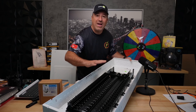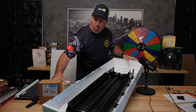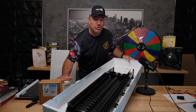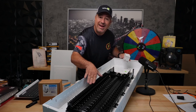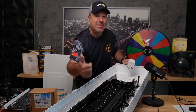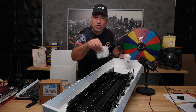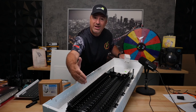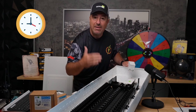This whole system ties into the Wi-Fi breakers. The Wi-Fi breakers have a symbol right there on the edge that says they're Wi-Fi. Some that are not Wi-Fi are not going to have that symbol. Every breaker comes non-Wi-Fi and also Wi-Fi, and the Wi-Fi ones are what make it smart. Now the biggest thing is that the breakers don't have any terminals — all your terminals are terminated in the panel. This is great for roughing. You're finished roughing everything in, but the painters and drywallers have to come in. You can simply take an arc fault GFI breaker, pop it in and out of each circuit and turn it on to make sure you have no dead shorts. That's how you get it certified and verified on camera. You don't have to take out any wires off the breakers. As an electrical contractor, that alone is going to save you time and money.